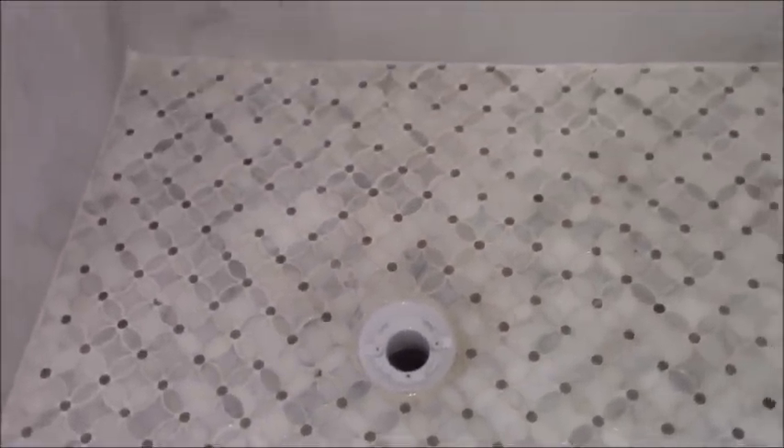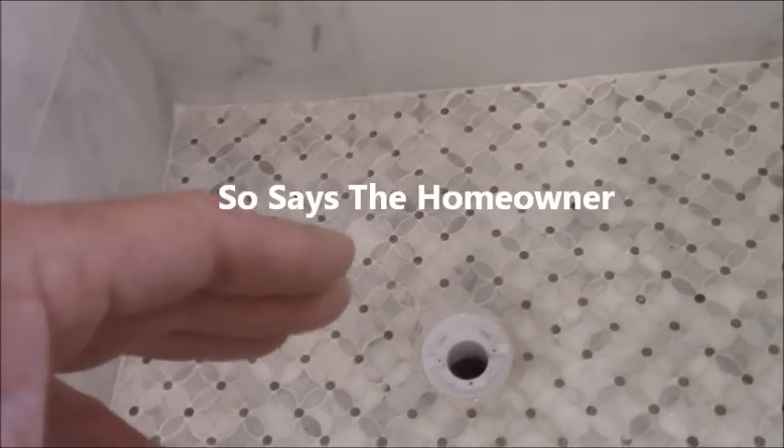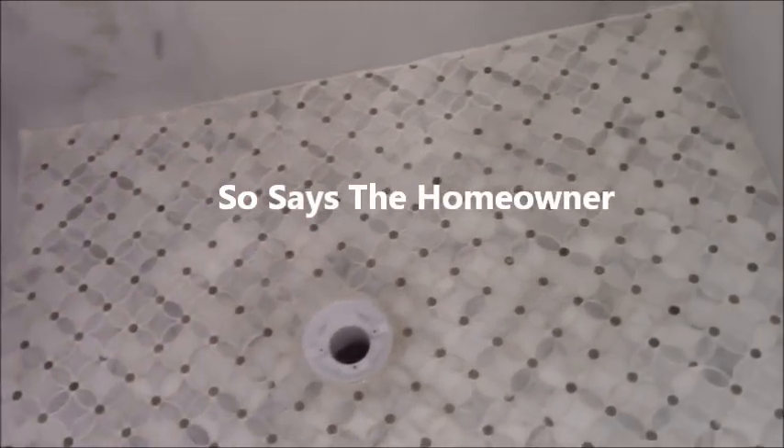The floor issue is really bad — this will not last. In fact, this shower was done wrong to begin with. The shower pan liner was cut so badly around this drain that as soon as you turn it on, downstairs there's a leak. So not only is the surface area not good, but it's not even functional as a shower because it was done wrong to start with.